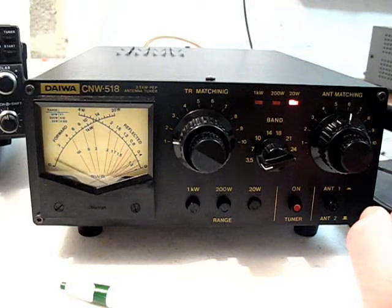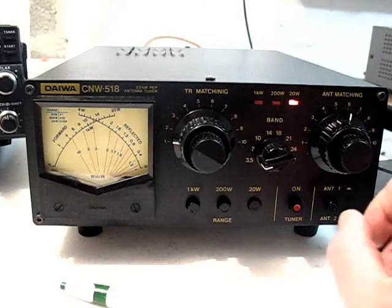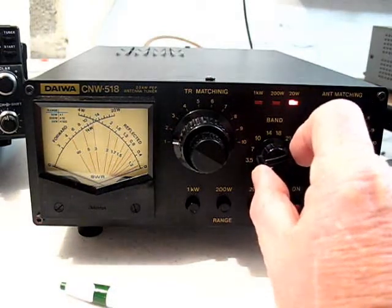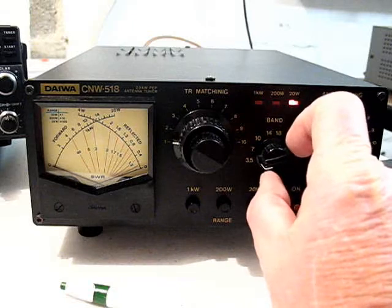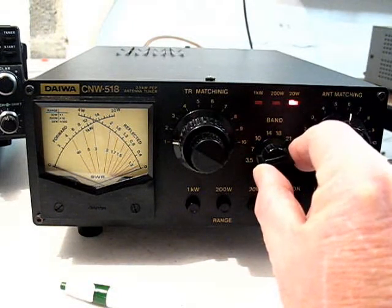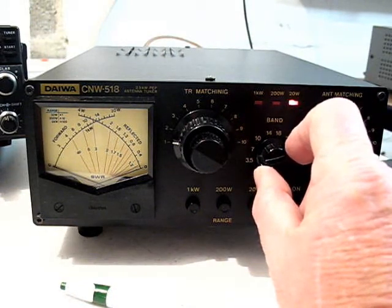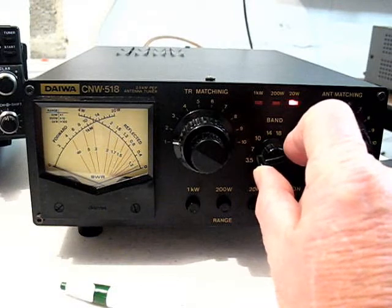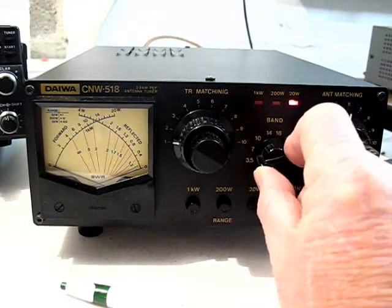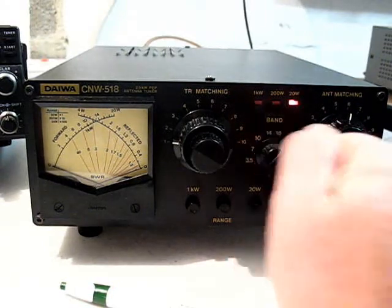Okay, I've got power out of my radio here. A little bit of power. I'm going to increase that. Notice the mismatch. I'm on 40. Now, I went completely through this tuner and spotted the frequencies. This must be on the upper frequencies. It has a wide bandwidth. So what it says at 14 is not at 14, it's at 21.